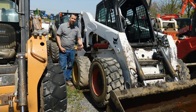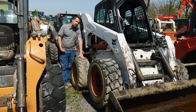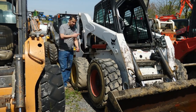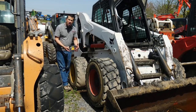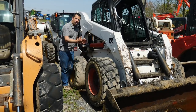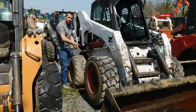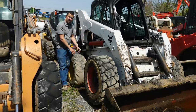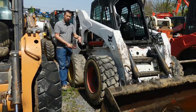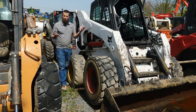If you look at this back tire here and how bald it is — if you actually ran this machine like this, this tire would likely get dragged along and forced to turn at a higher rate, which is going to accelerate its wear. At the very same time, the drivetrains, the chains inside of the machine that tie these two tires together, are going to be under tension that entire time as this thing is dragged along. Not good for your tire, not good for the inside of the machine. It's something you really want to avoid.